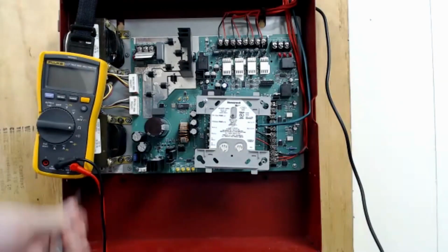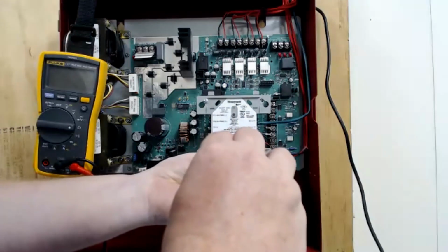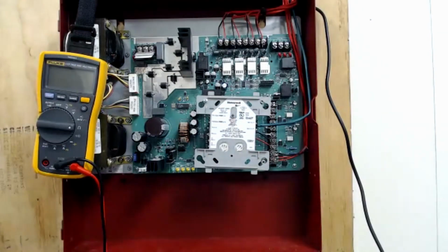So the only other thing you have to worry about with this, make sure you do your address on your control module. So I'm going to make that one module 1. So now it's addressed. When we go back to the panel and we put it in, we'll say control module 1 is the FCPS in Keith's office. And anytime it has a trouble, it'll direct people directly to right here, and your panel's trimmed out.